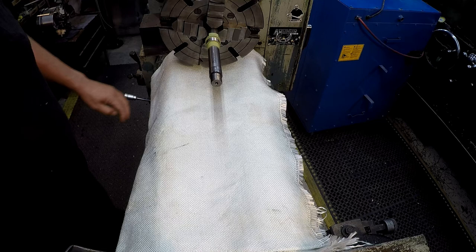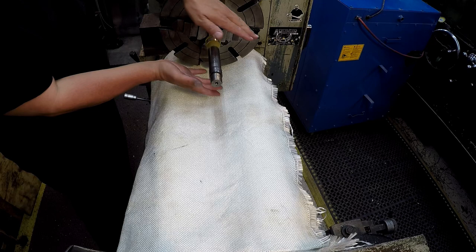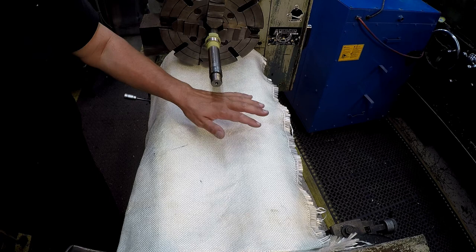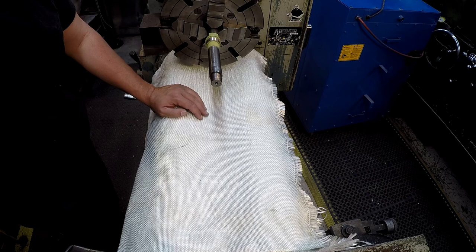But always make sure that you use one of these if you're going to do any kind of welding on the machine. It just helps protect the ways. All that powder that's coming out in a molten form, a lot of that powder is coming around and deflecting off, and it may come down and try to stick to the ways. But you can pick these up from any of your standard industrial sources for tooling and places like that. So just make sure you get one of these, and use it anytime you're gonna do any kind of spray welding or welding on the machine.